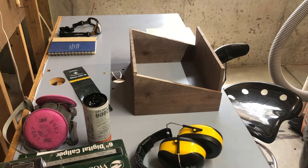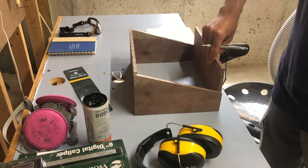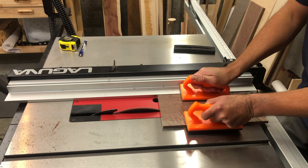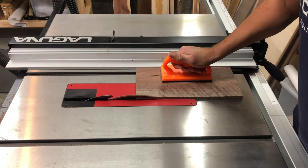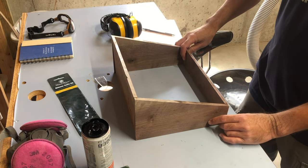Getting the two front and back pieces so I can put my angles on those to cut down here as well. I set my fence to the front piece and I'm just going to cut that flat part for the front. Then I set up for a 17-degree cut and cut the back and then the front as well.